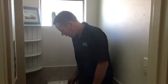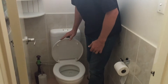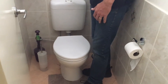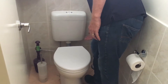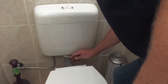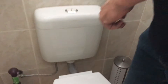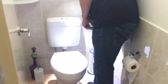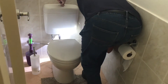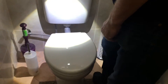A plumber should do that. The next thing you should do is check how strong the lid is and make sure it's on correctly. When you're testing the toilet, you want to be looking behind the toilet, because usually if there's a leak it's going to be coming from here or just behind the pan. Press the button and get a bright torch so you can see, then press the button and look for any leaks.